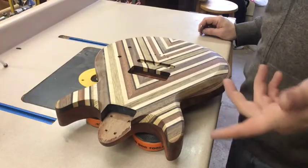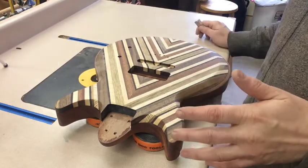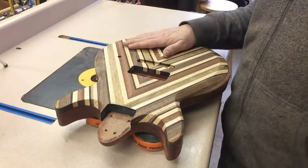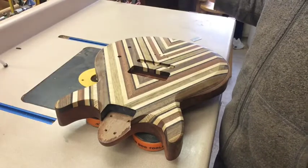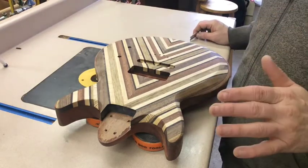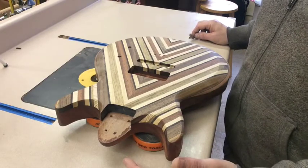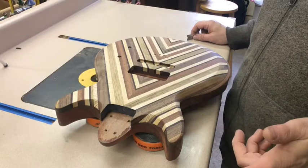Back to Part 2. Where we left off in Part 1, I put on my initial coat of Tru-Oil — real heavy in the cutaways and end grain sides, laid it on real thick on the top and back, let it sit for a few minutes, and then wiped it off. That first coat is just to start getting oil soaked into the end grain, but also to reveal any scratches I may have missed during sanding.